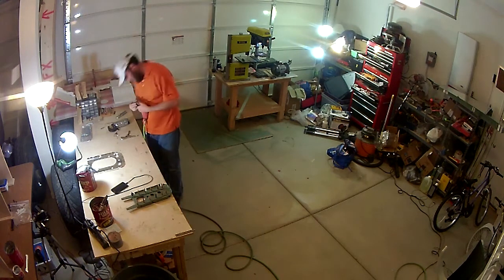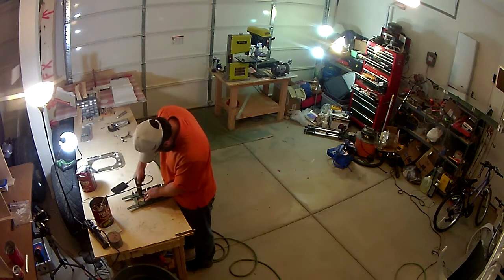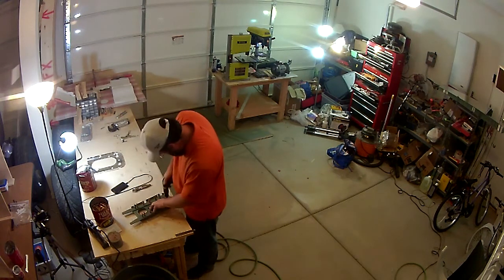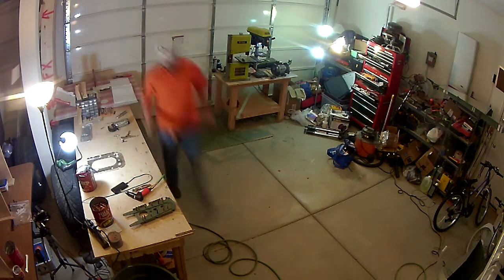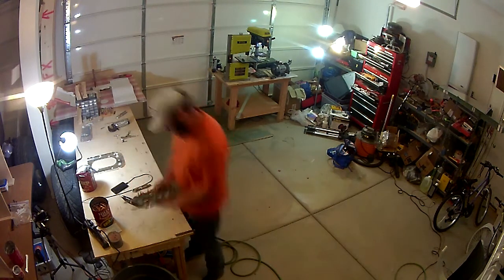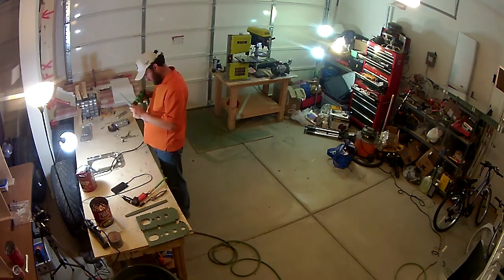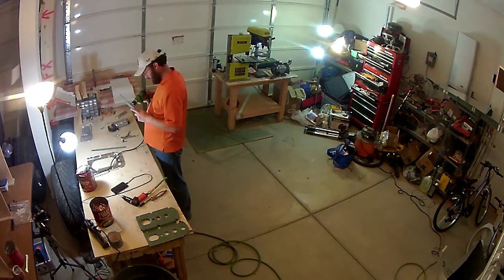Watching some of the other videos of some folks putting RV-10s together and talking to my grandfather-in-law about when he put his RV-4 together, this kit is so much faster. You end up not doing a lot of the tedious work that was involved in the other models, where you would assemble everything, match drill every hole, pull everything apart, deburr everything, then primer, then put it back together, then finally rivet everything together. This one takes out that middle part where you just assemble it, make sure it's all deburred, and go to town. So it's a whole lot faster.